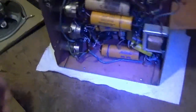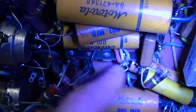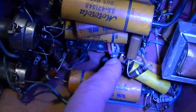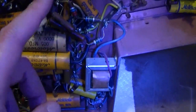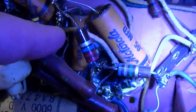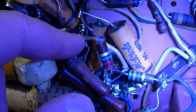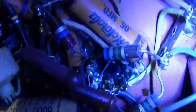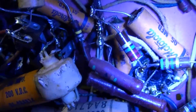Pin 3 normally in the older sets goes to ground. What you do is cut the ground connection and take this capacitor that's already in the circuit going to ground, cut that connection, add a 220K resistor, and tie pin 3 to that junction. On the socket, pin 3 is the orange wire — easy enough to pick off. It goes through a hole in the chassis and comes out here, going to this junction which is ground. You need to unsolder that, then route it to the 250 picofarad cap junction. Lift that connection, add a 220K resistor between that wire and that point — and that's where you tie in the orange wire. It seems to have done the trick.